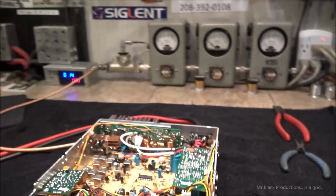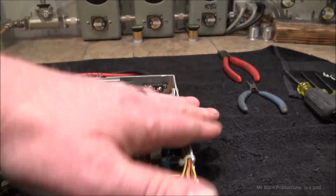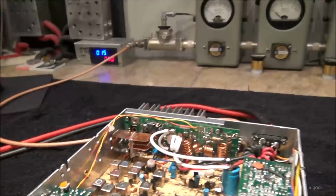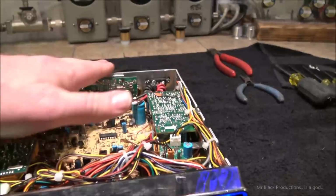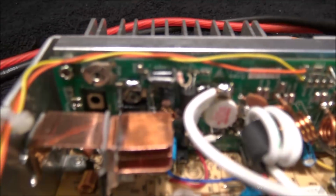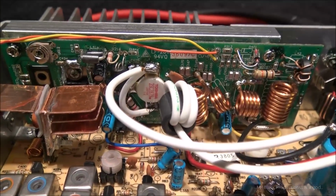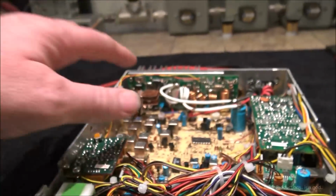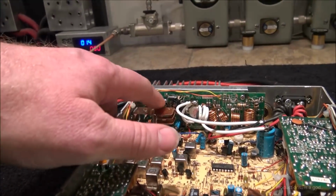And what I'm going to wait for is some upgraded voltage regulator for this radio. The other one's already got an upgraded voltage regulator in it. So that's where we lie with this one. It's about 200 watts. And that's with a 477 in it, an MRF 477, which is a hot final, going into a 2879.